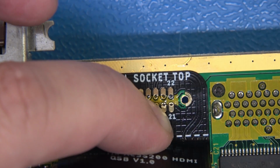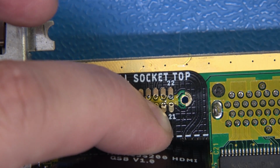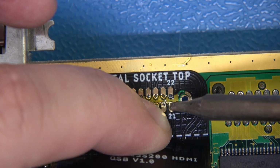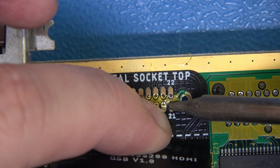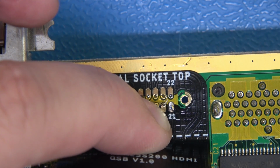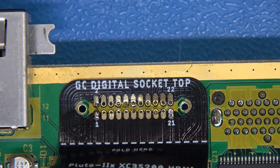So I'm going to come right down here, and we're just going to change positions. Now I'm going to come right like so, and I'm going to grab that tip. Now we should still have, as you can see, a healthy amount of solder. That's plenty to make a contact right here. Watch very carefully. It doesn't take much. We're just going to come in here, do a little swiveling. Beautiful. Now I'm going to let it go. Look, my hands are free.